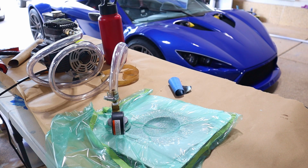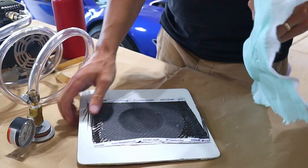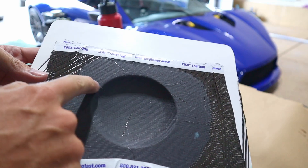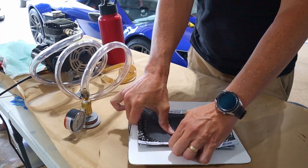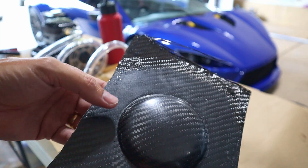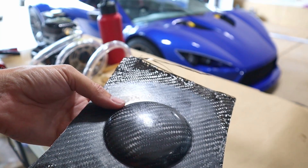It has been about 24 hours. We're going to go ahead and take this off. It looks pretty good. You can kind of see the wrinkles where the peel ply had wrinkles. Not too bad. Got a couple tiny places just where we don't have even resin coverage, but we're going to fix that.